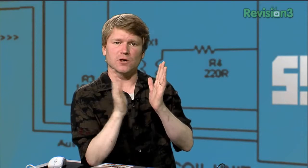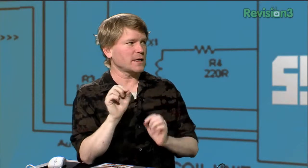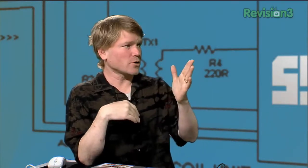It's exactly, and it's an interesting thing once you really start getting involved in microcontrollers, turning on an LED is basically sending current through that LED. And as Patrick mentioned, you can also use that for a relay. A relay is an electromagnetic device that closes when it feels current, and that connects another device. So you can use this tiny little amperage, which would normally turn on, say, an LED, to close a relay, and that relay then can carry AC current. So you could turn on a regular old 110 volt AC light bulb, using a board like this by replacing the LED with a relay.